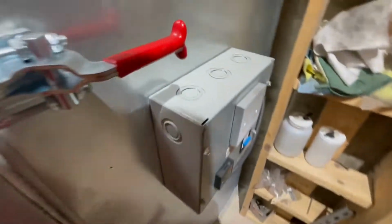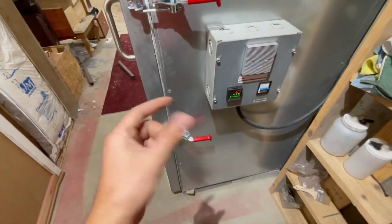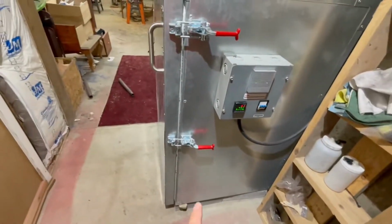But it's okay, when I'm reading this, if it says like 390 or 404 or 405 or something like that, it's okay to be within a small threshold because these aren't always 100% accurate. Also, since I have a part hanging at about here and a part hanging about here, the temperature will differ across the whole part because, like I said, the heat rises, so the top end might get a little hotter than the lower end. So I want to try to scan in the middle.